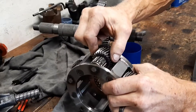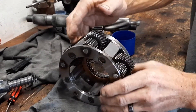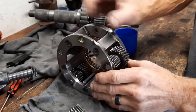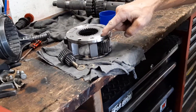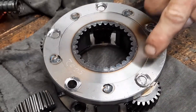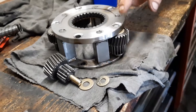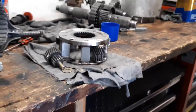There's a little bit of looseness but that's sure better than it was when I put this transfer case together a year ago, and it lasted a year. On this side you can see where I ground the welds out from the cross pieces — I've got to fill these back in. I'm going to tack it first, put it back in the case, make sure everything works really well, and then I'll finish rosette welding each of them.